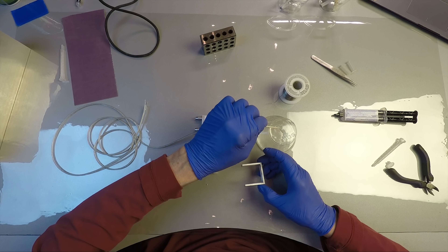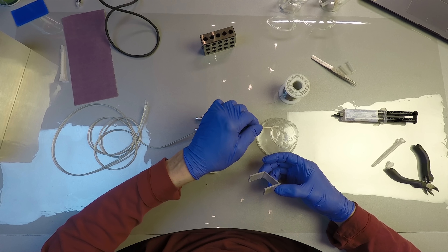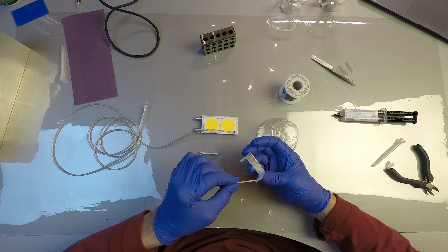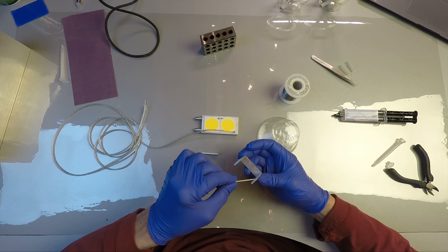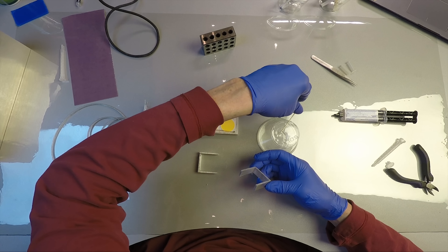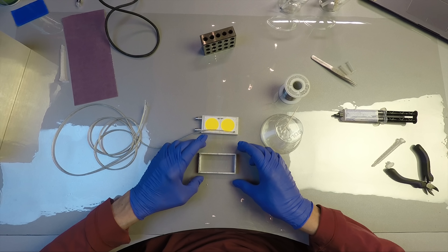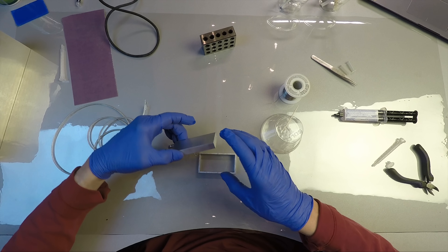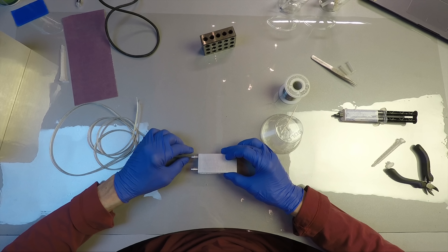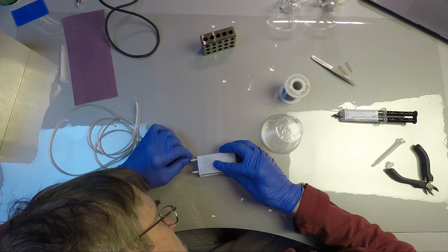Looks pretty good. One last step — we'll put a small amount here to join the two parts together. Now for the very best bond with aluminum, a little technique is to use an abrasive pad and actually sand the epoxy into the surface. What that does is the epoxy protects the raw aluminum you've made bare with the abrasive from oxygen, because oxygen forms an aluminum oxide which doesn't stick very well to epoxy. I don't really have time for that and I don't need a great deal of strength here — also I don't want to get any of that sanding compound onto the COBs.